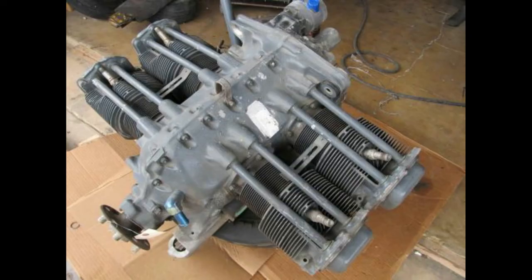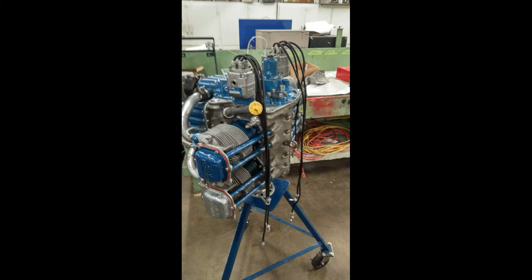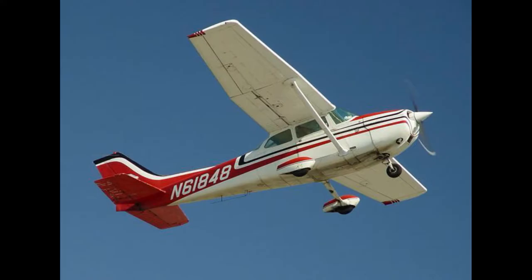So the engine my partner and I did was the Lycoming O-235-C2C, O meaning opposed, usually known as a boxer engine by most, and 235 meaning the cubic inch displacement. Not a very large engine at all, actually the smallest engine that we were all working on. This one was a little bit more difficult, since it was older, and Lycoming has pretty much stopped all support for this engine. This is an engine you would find in an early 60s version of a Cessna 150,